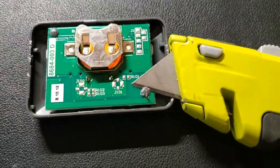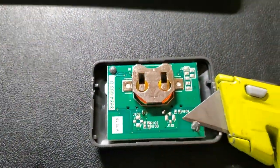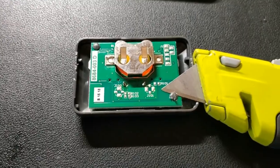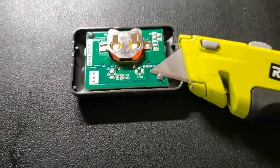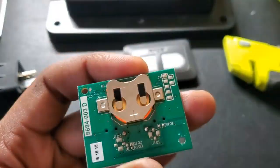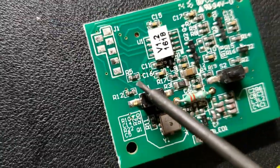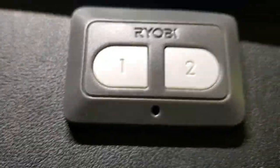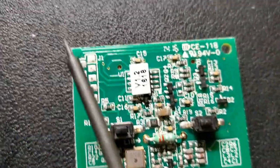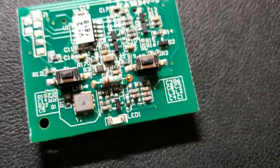The first part we have to do is open up the controller that goes in your car. It had these little gray tabs on it — I'm going to shave those off to gain access because they're impeding removing the circuit board without breaking it. Now I've gained access to the circuit board. S1 is the first garage door button labeled number one, and S2 is number two. I'm going to be soldering onto S1 — to that point right there and that point right there.